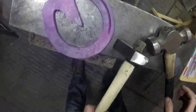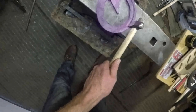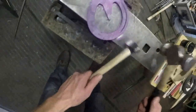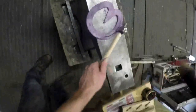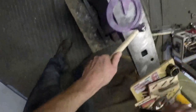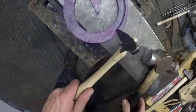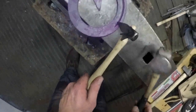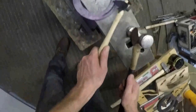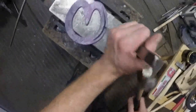So I haven't put a definite stop ending yet, but that's where my toenail's going to be. And I'll just do a raise out of it there, about 3/4 of the length of my fuller blade. Stamp it. So that was where my stop end would have been. Move it back a little bit. Toenail, heel nail, slightly more upright, and obviously middle nail. Not as much pitch as a toenail, but more than the heel nail. Stamp them through, pritchel them through.